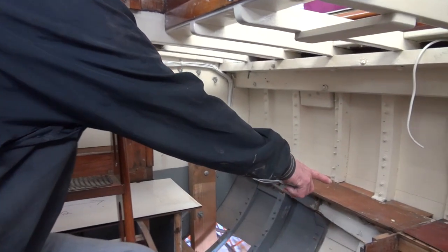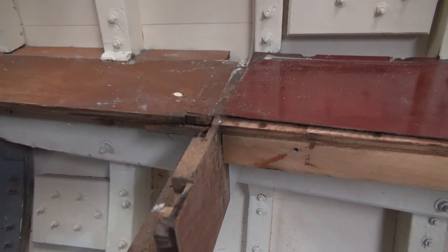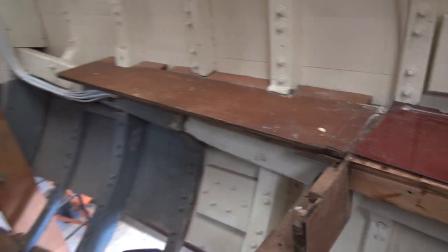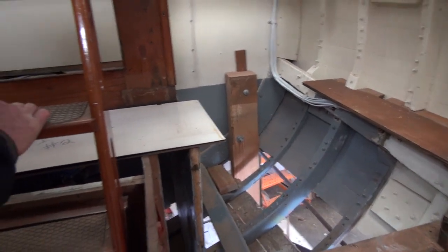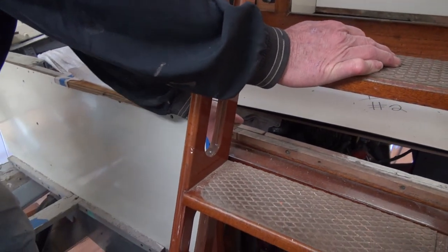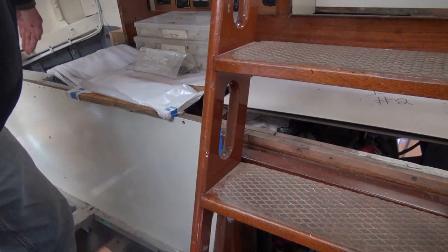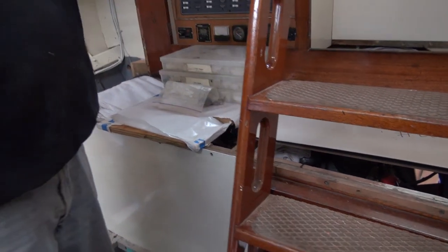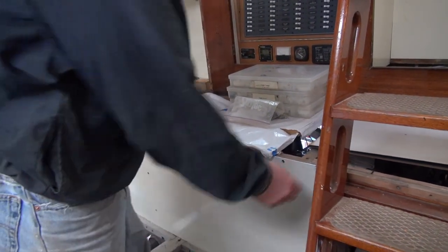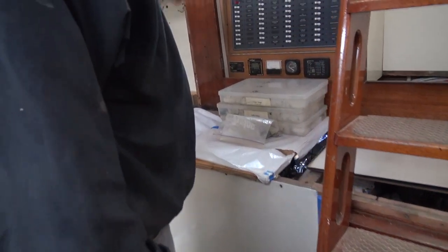See back in here — this is pretty nasty and the joints are going to fall apart. Same in here — this bulkhead is kind of adrift. I think we can just use one big support plate, force some glue down in here, and then put one big long cleat to stiffen it up, screwing and gluing — so it's not all floppy. The hanging locker back there we'll have to redo, but that's about it.